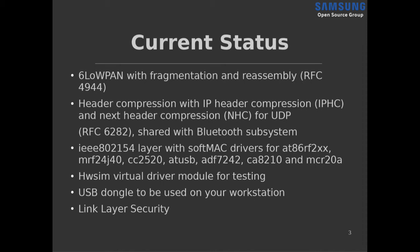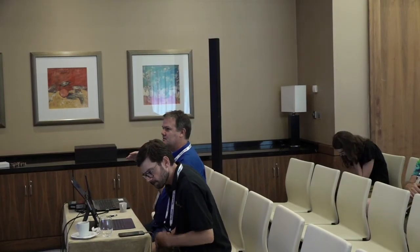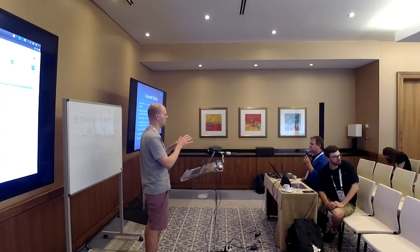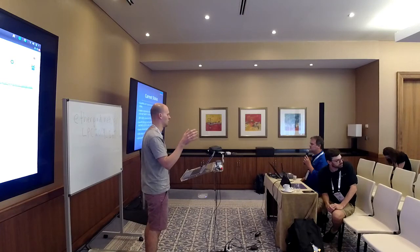Go ahead. As a total novice, I just want to ask a really stupid question right here. Sure. So when you have these SoftMAC drivers, where does the firmware live? So there's no firmware. Really, most of the devices I'm talking about here are really, really simple devices. The PHY itself, and then SPI and GPIO access to them.